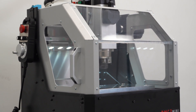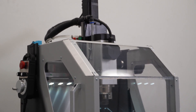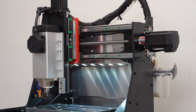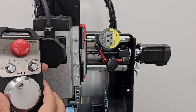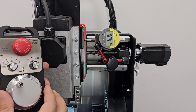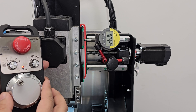A common question I get about the DMC2 machines is: can they cut small parts, specifically for watch components or jewelry applications? The machine obviously has the power to do tiny machining operations, but it also needs to be very rigid and accurate so that it can make small and precise movements effectively — otherwise small details will be lost and you'll break your endmills very fast.